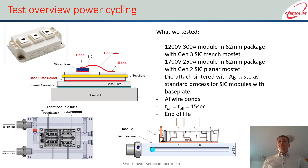We also have a sintered die attach, which is something we do as standard for all silicon carbide modules. We use aluminum nitride as the substrate material and aluminum bond wires — again, this is standard process for most of our modules. We set a cycle time of 15 seconds on and 15 seconds off, so a total cycle length of 30 seconds, and we ran the test to end of life.